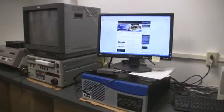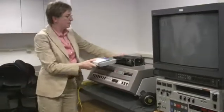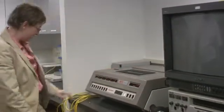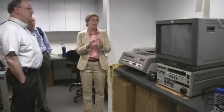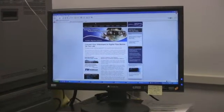This portion is the beta test part. This is our tape cleaning machine. You put the tape in here and you can watch it run. Basically all it does is take the tape out and clean it front and back. Among other things, it probably compresses any oxide that may have fluffed up. If you talk to chemists about this, one of the things they're thinking is that maybe it's shifting from one iron oxide metal formation to slightly another one — it may have expanded a little bit.